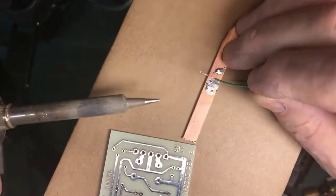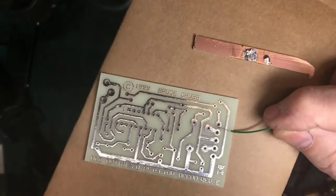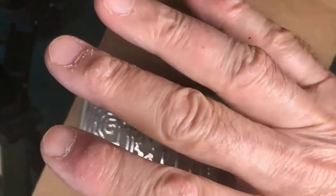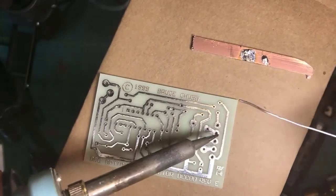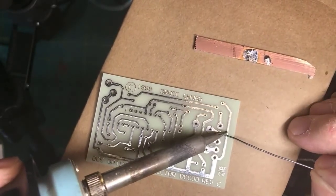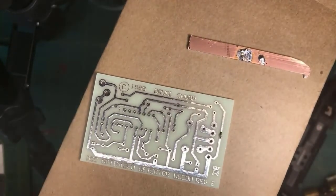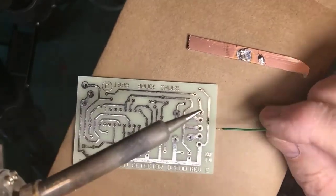Okay. Let's go back here, Ken. So what you're talking about is you want to tack on here. Yeah. Right. Again, wire cutters. One moment. Let me prepare for a demonstration of how to do this. Again, tinning is going to help you. The little thing you want to go on to, okay, I've put a tiny amount of solder there. I have a tinned wire.